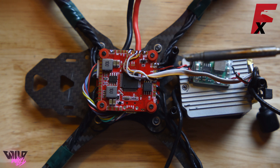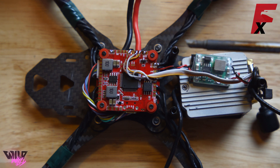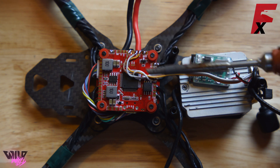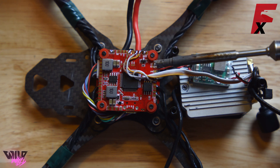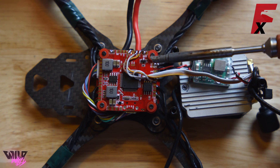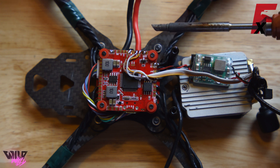All of this stuff will automatically detect through the Falco X Wizards. If you're using the DJI S-Bus it's going to detect that, and it will also detect that you're using the DJI FPV system and set things accordingly in the flight controller. There's one more step you have to do inside the DJI goggles once you get this set up through the Falco X configurator. Since we don't have 100% DJI OSD support yet, you'll need to use the Falco X companion app — a link to the new alpha builds will be in the description. We do have the ability to change PIDs, rates, and filters in the DJI OSD, so I'm going to hop on the goggles and show you exactly how to set that up.